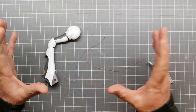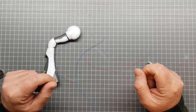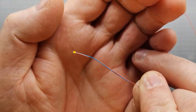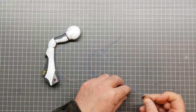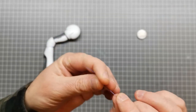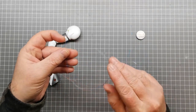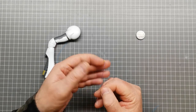Normally for a kit with so many lights I'd use fiber optics, but because of the way this kit goes together, fiber optics probably wouldn't work well — there are too many sharp corners they'd have to go around. So I'm going down the path of using 15 individual LEDs. The ones I'm using are tiny Litz LEDs, warm white, and they pack a pretty solid punch for something so small. They're 2mm or so, relatively inexpensive if you're buying via eBay or AliExpress. If I need to color them I'll use clear Tamiya paints.